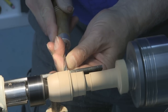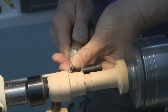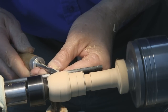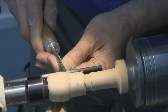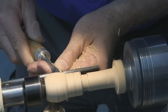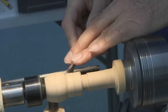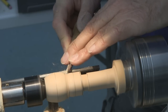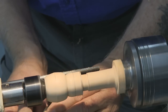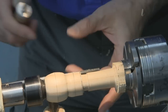I'll take away some material here, then start the same way over on the other side — just round it over. Here, since I am going down into a V cut, I've got to rotate the tool, move the handle over, and end up with the tip of the tool vertical down in that V. Then I'll come over to get rid of some material in the way. The tool rest is just a little bit too high. I can feel a little bit of a raised area in there — I'll clean that up.